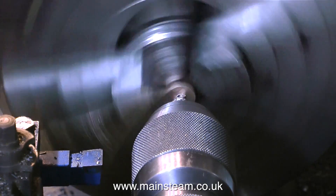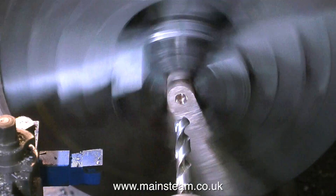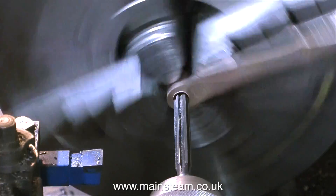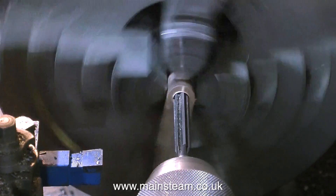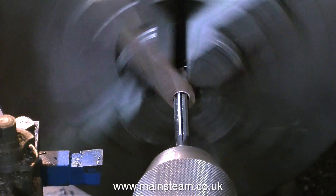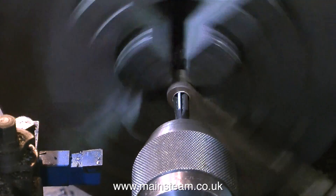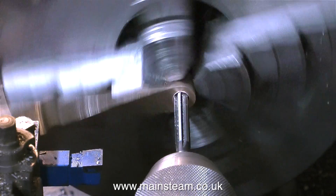The drilling of this part is almost identical to the drilling of the link arms. First of all I use a centre drill, followed by a twist drill one imperial size less than the final size I need, and then I slow down the lathe by putting it in back gear and slowly feed in a 5/16ths of an inch diameter reamer. This isn't a precision part — it's a lever that fits on a shaft — but it needs to be what I would call an engineering fit, definitely not a rattle fit. It's going to be pinned to the shaft with a taper pin, so if the lever is a good fit on the shaft to start with, the taper pin is just the icing on the cake.